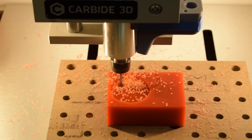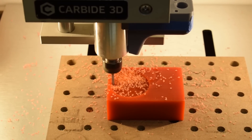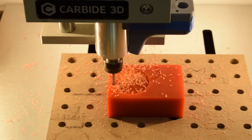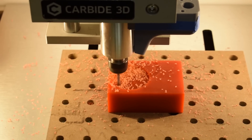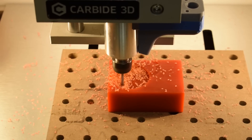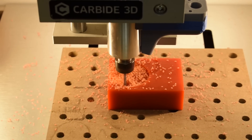The biggest risk with machining this stuff is melting, and a lot of people interpret that to mean you need a low RPM. But with smaller diameter tools, your surface footage — the speed of your endmill at the cutting edge — is actually quite low. As long as you keep the tool moving, it's really not that big a deal, and with wax being so soft we can take a very aggressive cut.